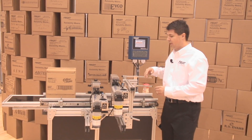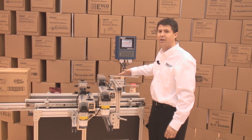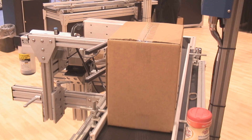We've got a couple other things on this conveyor belt that are unique. We've got an integrated guide bracket, and what that does is protect the print head from any kind of box mishandling. So if a box comes through a little bit skewed or a little out of whack, this will actually straighten up the box and it won't damage the print head.